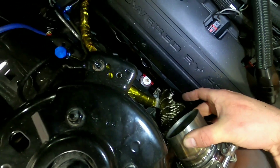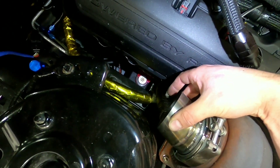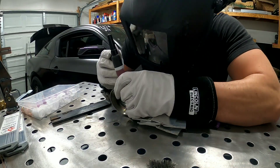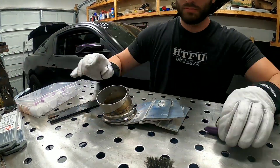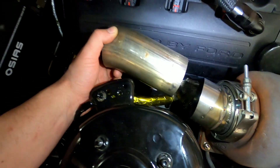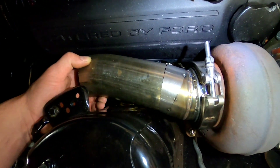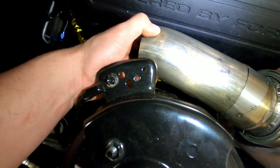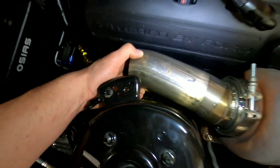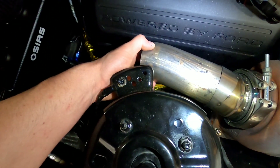Also with this other pie cut, I'll keep it kind of away from the valve cover. I'm going to start working it back towards the strut tower, but I'm going to get this tacked on and then work on the next piece. This is just a piece I had laying around from somebody else's car, but it is nice and straight cut on the end of it, so I am using it to kind of mock up. That's about what I'm thinking right there — it'll be right about the height that I want it. Then I'm going to start using the pie cuts to get it to turn out, and I'll cut a piece that's the right length of some nice fresh stainless and get this one tacked on too.